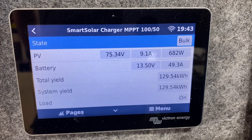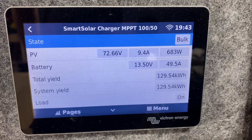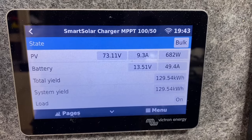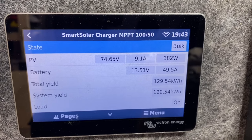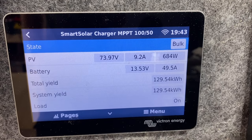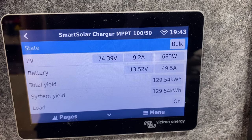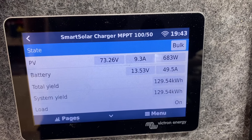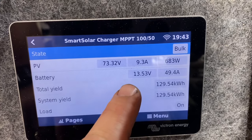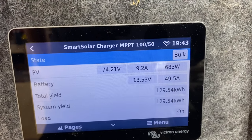Here's something a little bit interesting. I have removed the load and the voltage is going up — now take a look at the watts. We were at about 660 before, because keep in mind this charger is limited by amps, not by watts. Going back to our 12, 24 versus 48 volt conversation — the higher the voltage, the more watts. So as this voltage approaches even 14 volts, we're going to see closer to 700 watts.